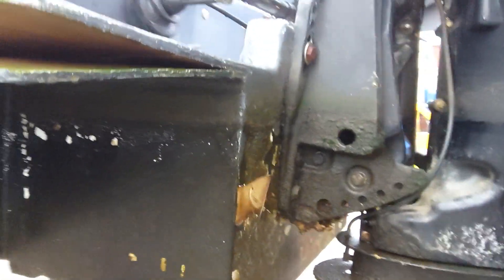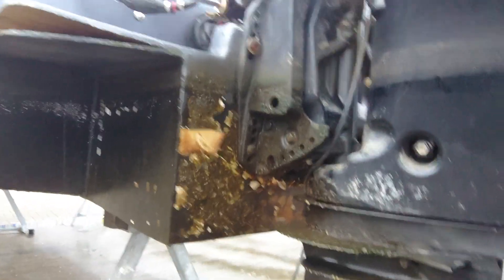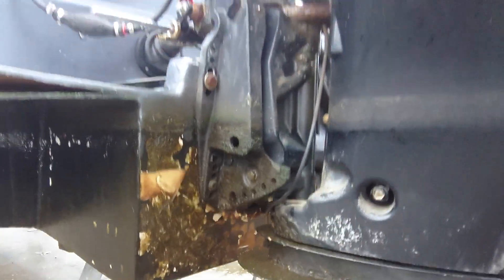And that's one of the other troubles — when you're fitting something like this on an old boat, if you try to glass onto it, the resin and the mat you're glassing onto has got to be dry enough to receive it.